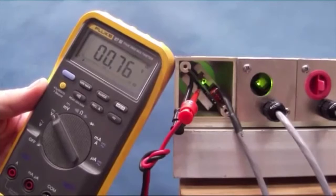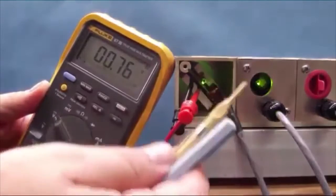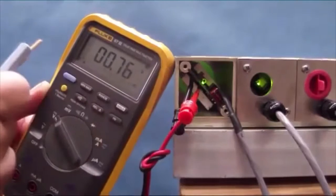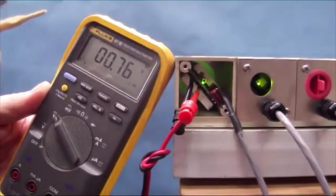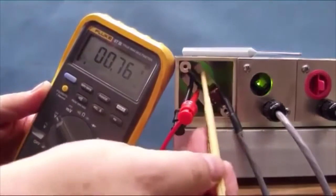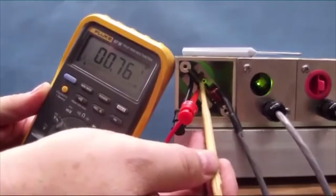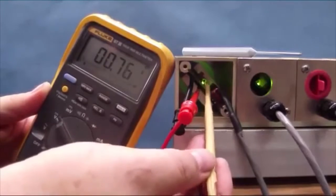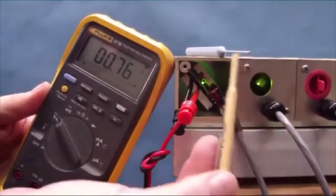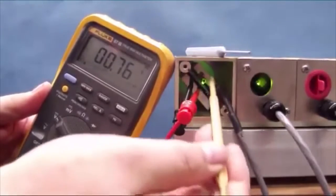During the tuning process, we're going to be doing 5 steps and using 2 screwdrivers, a tan and a blue one. The 5 steps involve switching back and forth through the screwdrivers to make the right voltage settings on the display. So the first step is take the tan screwdriver, find the potentiometer, which is to the left of this bright LED. The green LED is illuminating the adjustment area. Right above the LED is a tube. That tube is for the blue screwdriver with the narrow tip so that it can fit inside the tube, and the flat end of the tan screwdriver is used to adjust the potentiometer.